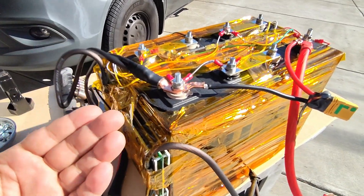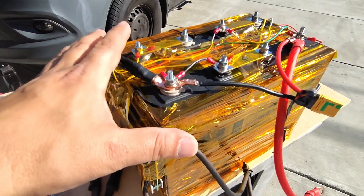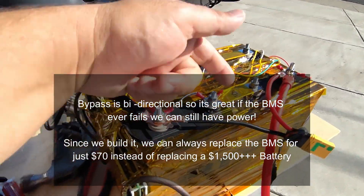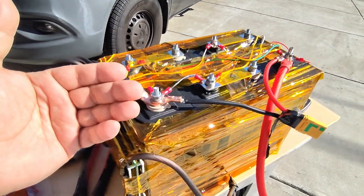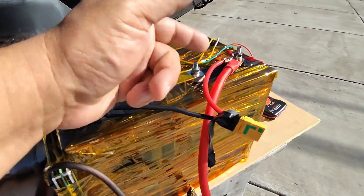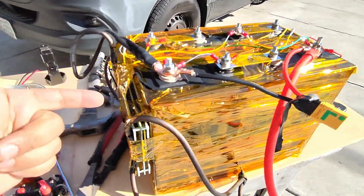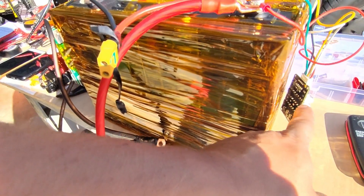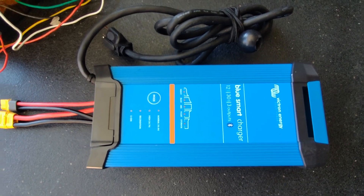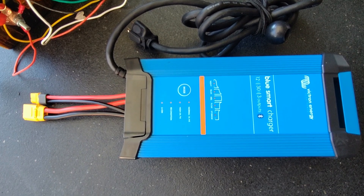You might not spend quite that much, but at least everything is accounted for. For $600 you get an amazing battery, and since we're building it ourselves, we'll include some nice tweaks and bypasses. In case the BMS ever goes out of whack and thinks it's full when it isn't, we'll be able to bypass that function and inject power directly, while the secondary BMS handles balancing. The battery charger itself will be a smart charger made for this specific battery chemistry. I'll have links to everything below.